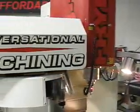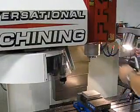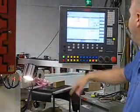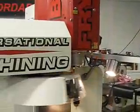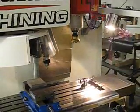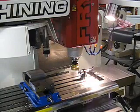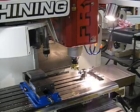Since this is a wired probe, the machine is going to prompt me to remove the tool. I take my tool out, start it again, and grab my face mill. From here, it's going to automatically pull over to the location of the probe, start the spindle backwards so it won't damage the probe, come down and touch it — and now it knows the length of that tool.